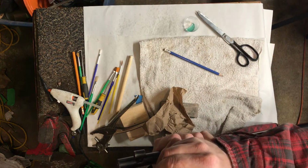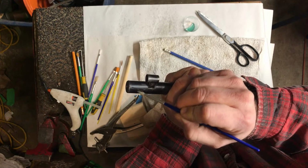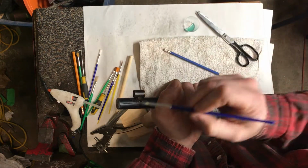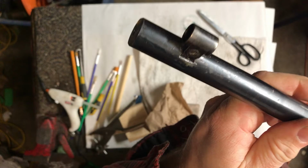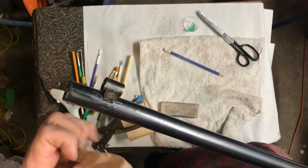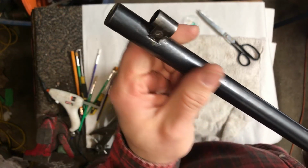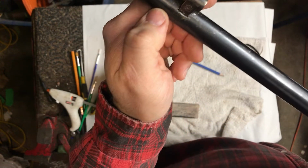I'm going to get a little bit more here, and then we're going to go this way. I don't know if you can pick that up, but the crack itself is picking up more blue than the rest. We'll do this gouge here. Same with the gouge. You don't want to wait too long, but I'll show you guys. See how that's highlighted? There you go, there's a good angle. You can see where the gouge is. So again, you want to come in, sit for a second, not too long, and you can see it changing color in front of me. We dab it, and we blend it. Okay? And now it's widened a little bit. So you can kind of see it there.